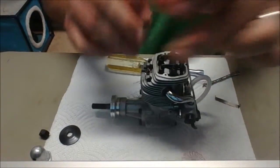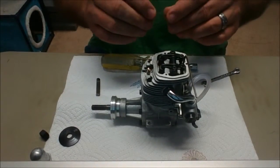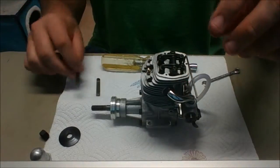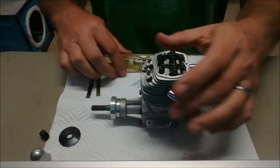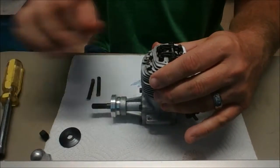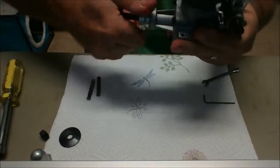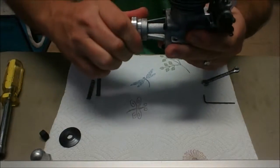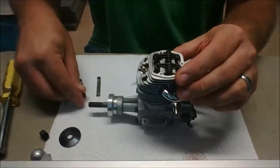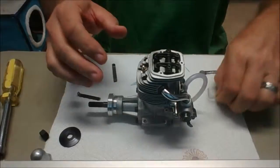So now I should feel just a small amount of tension when I do that. Now what I call the no-go gauge — the 0.1mm gauge — should not fit in there at all. So that's the proper way to set the intake and the exhaust. I'm going to pop loose the glow plug, and after I set one of them I usually just rotate it through a couple times and re-check it. Stop at the top, get my no-go gauge — still no-go there, still good there, and I feel a slight nip.